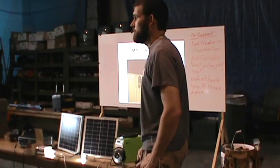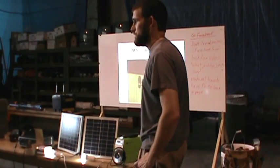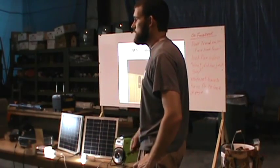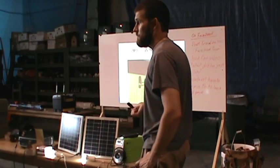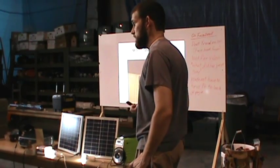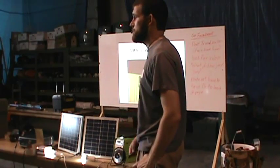Even the cost of the electrical wire to run to each spot and everything? I still would just do it from one place. Because think about it, the money you would spend on wire, you're going to spend on disconnect boxes, and you're going to spend on extra batteries for that place. Before you're said and done, you come out better just to run the wire.